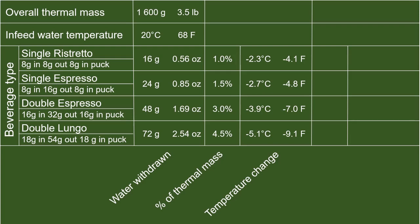This is superior to the original bi-metallic thermostat controlled stock version, yet it is far away from commercial machines. There is another way to overcome this issue called intra-shot temp surfing, but that isn't a convenient or super consistent solution and it requires a lot of practicing.